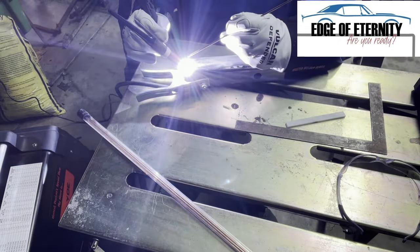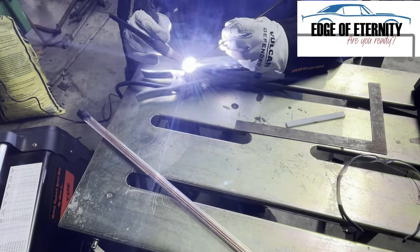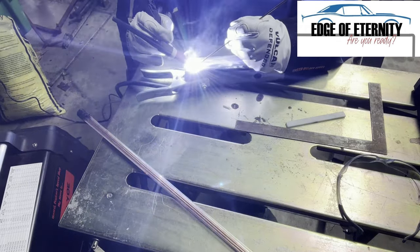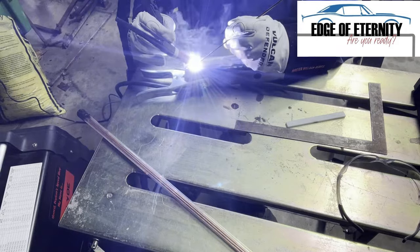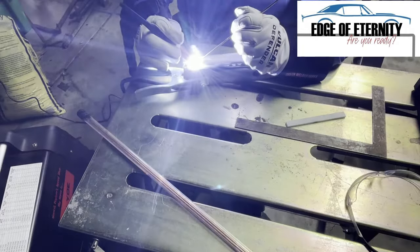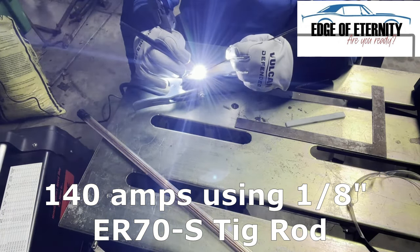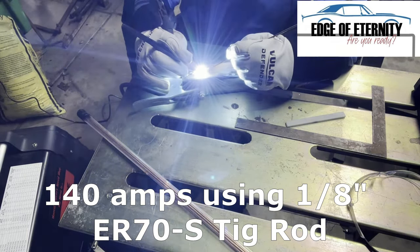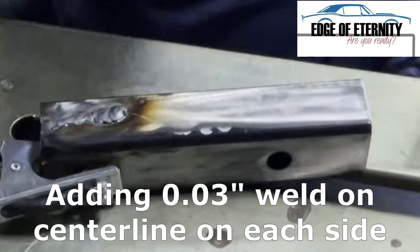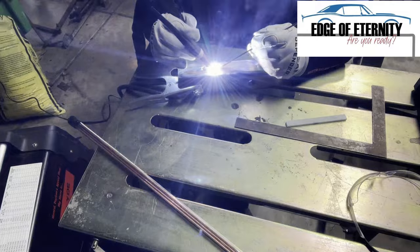Here we're going to lay down the first weld. The biggest challenge I had on this was keeping a straight line — I was having trouble keeping a straight line going. I did use a soapstone and add a line, but it was still really hard to see, so I was kind of freestyling it as far as making that line straight. But I was really happy with the welder and how it's working. I'm welding at 140 amps using one-eighth ER70S TIG rod — mild steel — and this seems to be working just fine. I'm adding 30 thousandths of weld on the center line of each side.